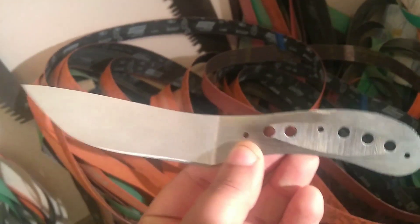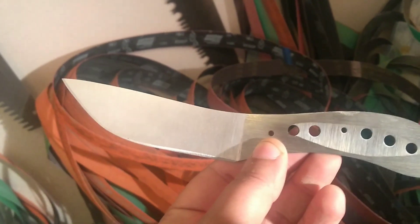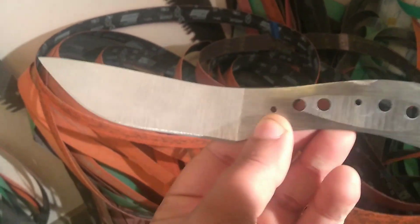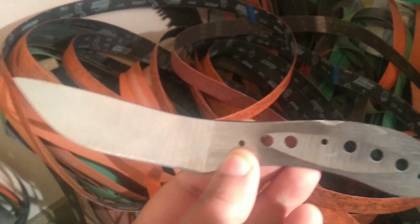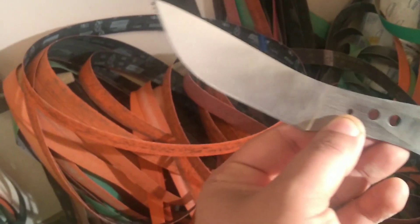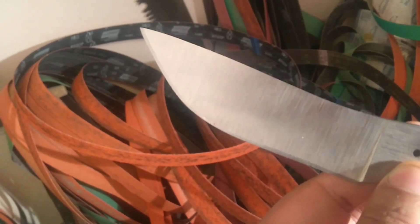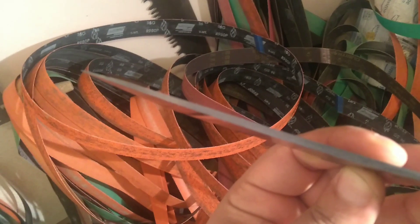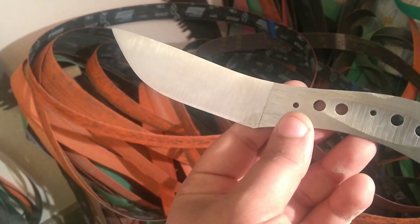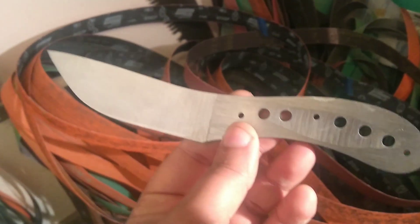I get people saying 'I love your work but it's really expensive.' Look, I could just make the knife like this — yes, it's REX 121, I could sell it based off the steel name and my heat treat. But the real magic to a laser high-performance edge geometry knife is taking that bevel and making it small by grinding it thinner, increasing that taper. That takes belts, time, skill, expertise — making sure you're not burning stuff up, water-cool grinding, all that.